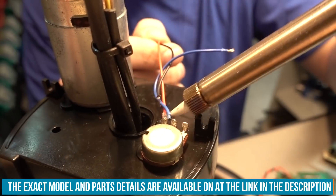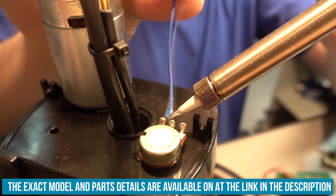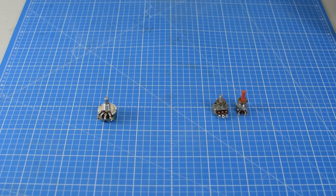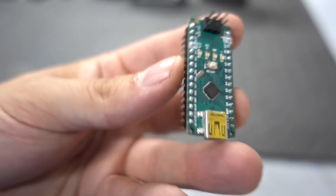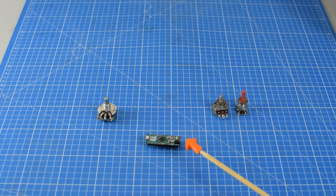Two of these will create a 2.4 GHz network. Let's look at the basic concept. The steering wheel and the pedals are basically just potentiometers — one for the steering wheel, one for the brake pedal, and one for the accelerator. We could read these with any microcontroller, for example an Arduino Nano, and use that data to transfer it over USB, serial, or any other protocol, or use some wireless components to make it talk to another Arduino.